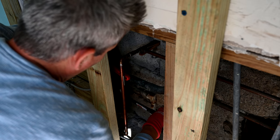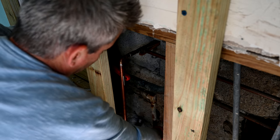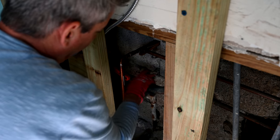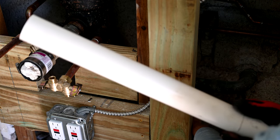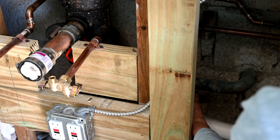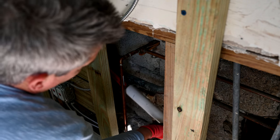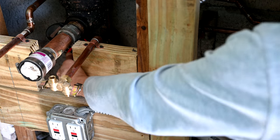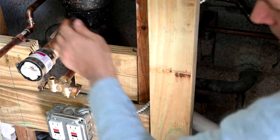You're going firmly but not slamming it — you don't want to shatter anything. Just over the course of four or five minutes, keep doing it and see. Then you can try pulling it by hand or slipping a pipe over it. I have my wrench on there now, and I'm going to use this length of PVC pipe — schedule 40, real thick. You're better off with a galvanized pipe, but let's see if this will do it. I'm going to slide it right over the handle, just enough to give myself some good leverage. We've already banged the wrench for a couple of minutes with upward love taps — let's see if we can get this to go.